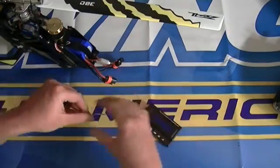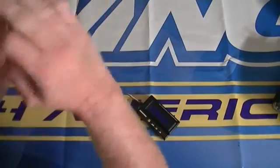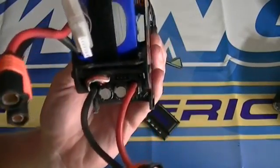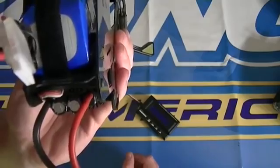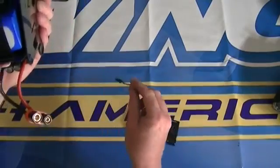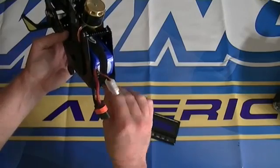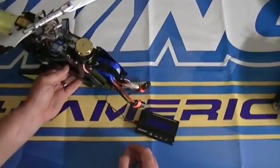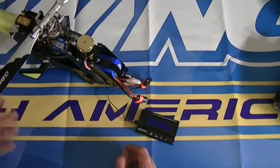The signal wire goes into the ESC port, and the negative is the black wire. This is a HobbyWing 100-in-1 Platinum Pro 100. Because of how it's positioned, it can be hard to tell where negative and signal are — just remember the signal wire is on the inner part toward the middle of the plug. Plug that in, and this is where you can use an external power source if you have the throttle cable unplugged from the flybarless unit.